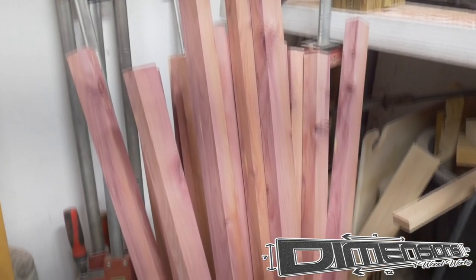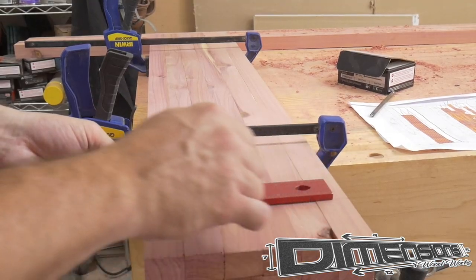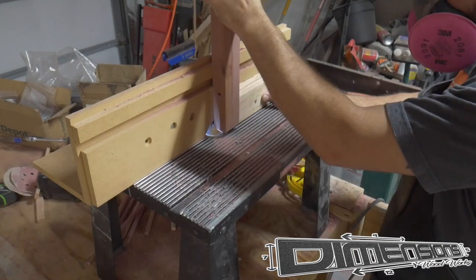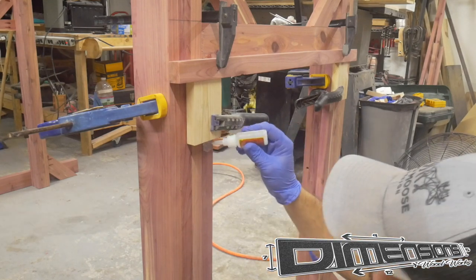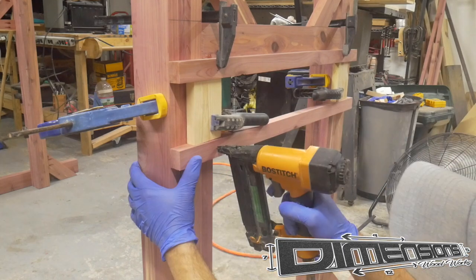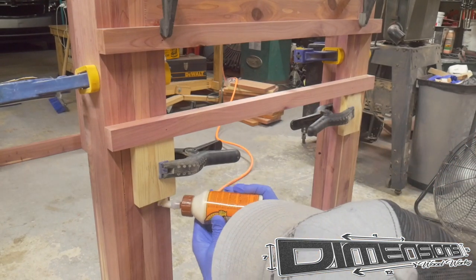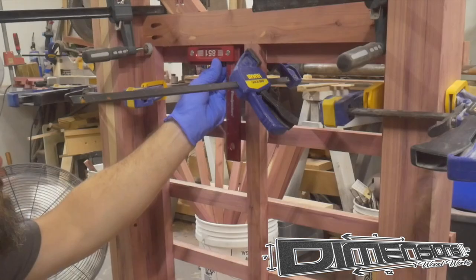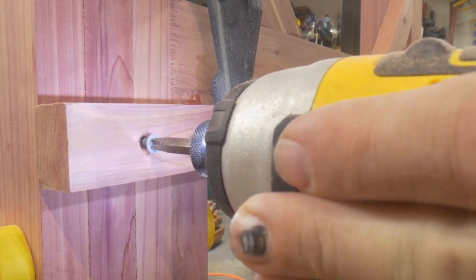Then I began to cut down several pieces of this thinner stock. You can see my bundle here, and these pieces will become the pergola style top as well as the lattice work that go on either side of the swing assembly. In keeping with our 45 degree theme, I decided to add a 45 degree chamfer to the face of all of these top pieces to add a nice little design element. Then I started putting together the pieces that will form the lattice work on either side. I cut myself a spacer block to make this process go a bit faster, then just move those blocks down, tack in the next piece, and move forward from there. I'm using wood glue along with CA glue to get a strong bond that will bond quickly to allow me to keep working. Then I just attach the lattice frames with screws that I will counterbore and plug later.